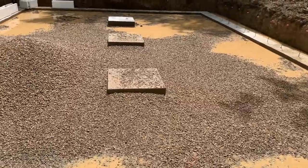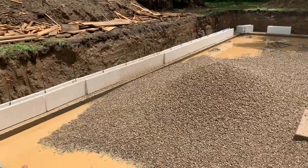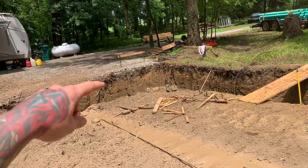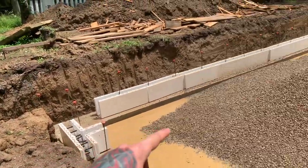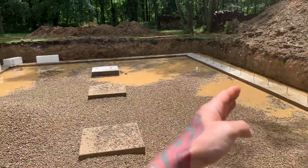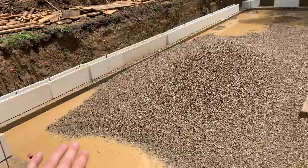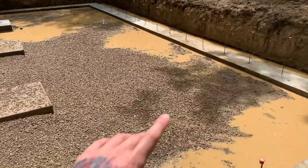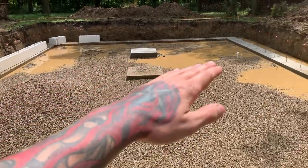That slinger truck was able to throw the stone a good 40 to 50 feet or so. We were able to make it over the entire garage — this huge hole here is about 30 feet, and probably another 10 to 20 feet beyond that. He really just arched it up; he started spraying it back and forth, and then I told him just dump it in a pile and we'll go ahead and push it all in here. The goal is to have this 57 round about three inches deep all in here.